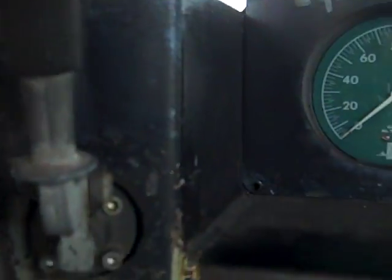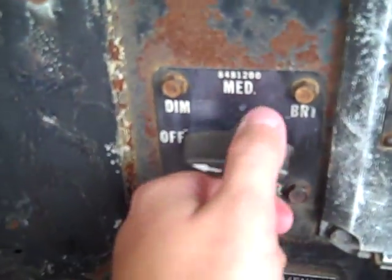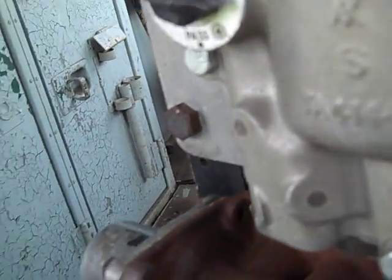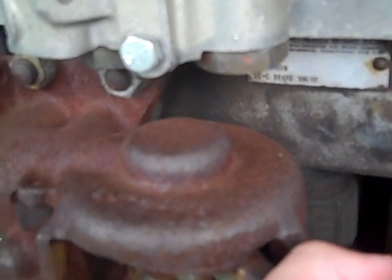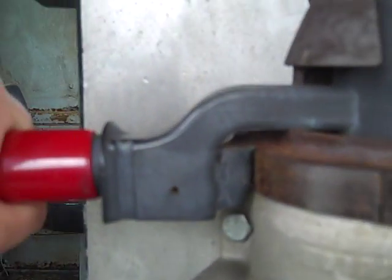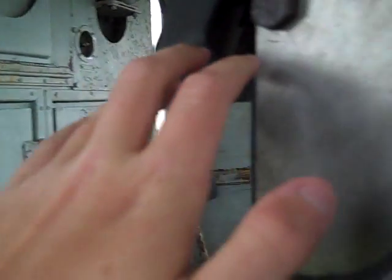Here is the horn, and down here is the bell. And here is the rear headlight switch. You're probably wondering why there are two brakes. This one is the locomotive brake handle — it controls brakes on the locomotive only. This is the train brake like we said before. You pull it towards you to apply the brake, push it out to release.